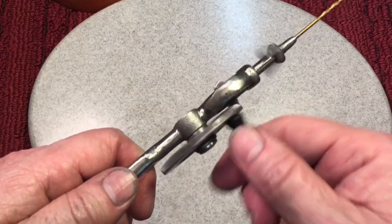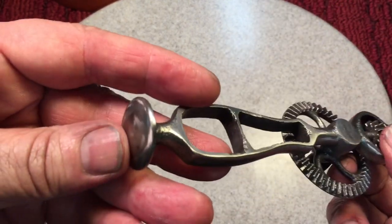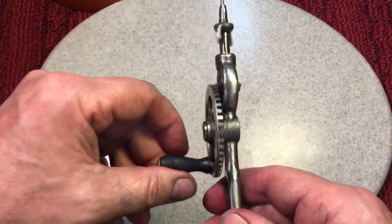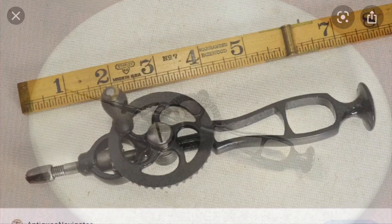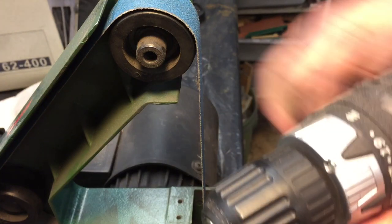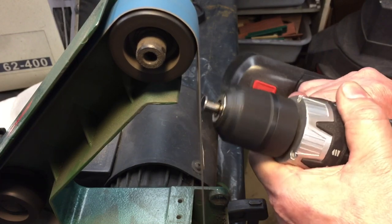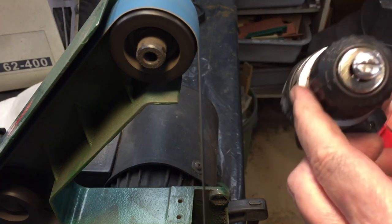I have it so lubricated and it's just sweet now. All the teeth — ground them down, filed them down. We're not finished yet, but it's definitely pretty cool. This has got to be painted, but there are some highlights and you've got to think about what paint scheme you want. I tried to research this drill and couldn't find any maker's mark, but I did find a similar one online that had a small chuck, so we'll have to fabricate one on the lathe. For round or domed pieces — like the screw that holds the drive gear — one good way is to put it in a drill and spin it against the belt sander. It makes quick work of getting out all those years of scratches, dings, and dents.